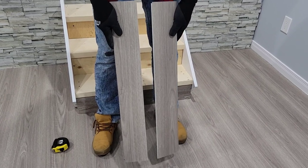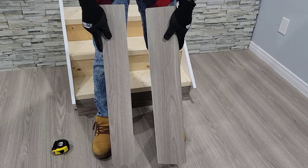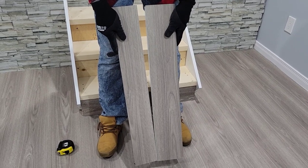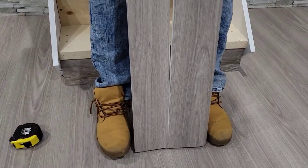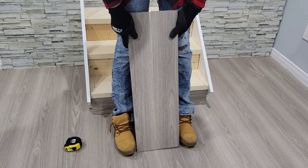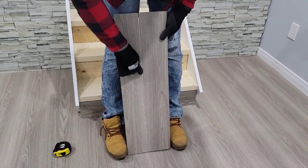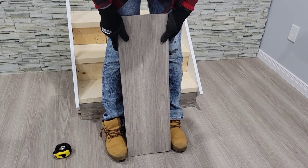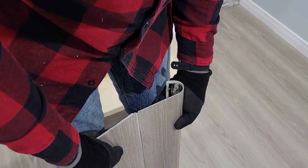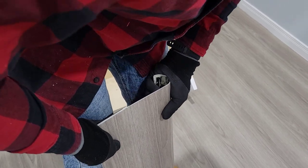When the vinyl is molded into the nosing it will no longer click the way that flat vinyl does. So to connect your nosing to the next piece to complete your tread, you're going to want to work with the boards vertically. Start by lining up and clicking the bottom, then hold it tight with your feet on either side. You may notice a small gap at the top, but the key is that the bottom is clicked together and held tight with your feet. Move your hands to the top and while holding the boards on a slight angle, push them together till there's no gap while straightening them and clicking it into place.